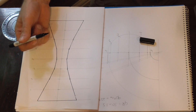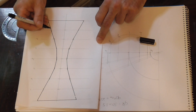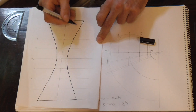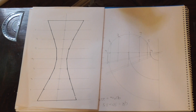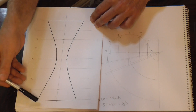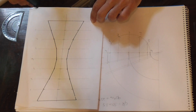There we have it, and again the same as when we made the back — you put the holes in on line number one, close to the edge, usually about two millimetres. I'm just going to put a dot in just so you know that's where you are. Normally you'd cut it out and then mark it on with dividers. So there we have it — that is the throat template. This template gives you a starter and a finisher and one segment. To make a starter you'd use half the pattern — around here, there, and then straight down here to make your starter and your finisher.